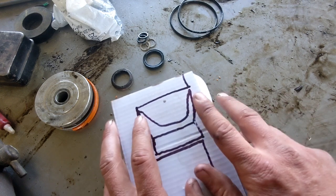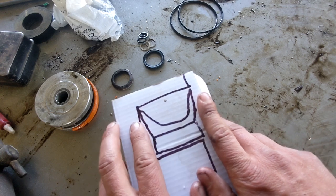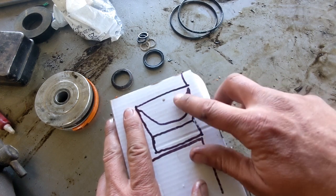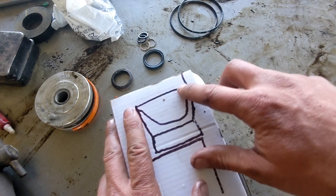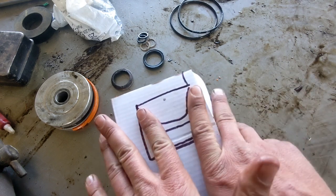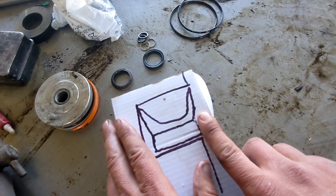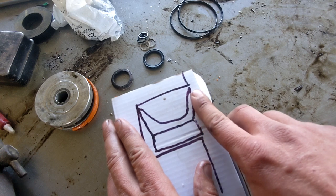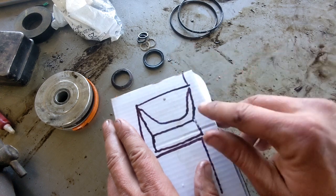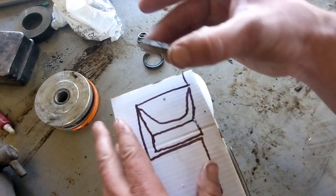So the way this works, though, is that when your rod comes in, it actually pushes up against this seal, and then this side is pushed up against the little pocket that it mounts in, right? And then as pressure comes in, this isn't drawn very well, it would actually be kind of a gap here that the hydraulic oil can get to it. But when this side is pressurized, it folds these out against its sealing surfaces, right? But on the rod's path back, if there was any crap on here, it can drag it through here. Because this is kind of facing the wrong direction, it can pull it into your oil, which can damage the seal, and you get stuff in your oil. That's not good.